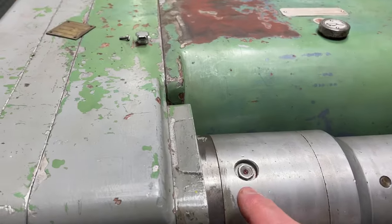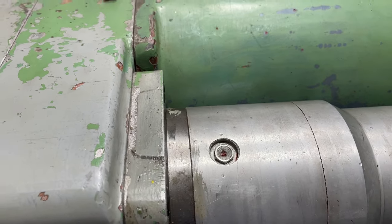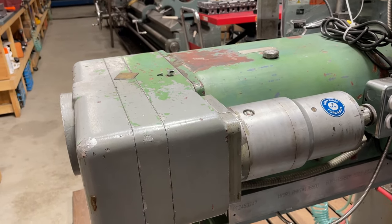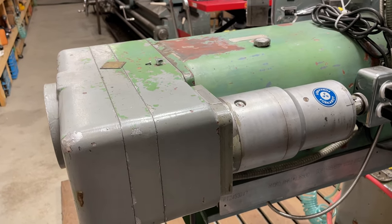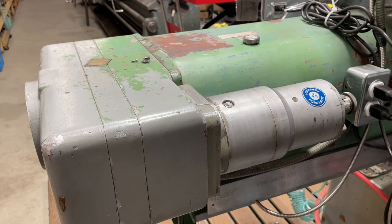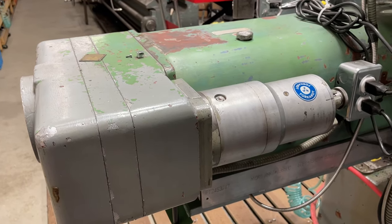And then I kept trying it, and over time grease was coming out of this hole, where you're supposed to grease it, and a decent amount. I found out I just had too much grease in there. And once it had spit enough grease out, it started working fine. Now it works really well, and grease is no longer coming out. So fairly soon I'll start actually greasing it again, as the manual tells you to. But that's the power drawbar on this machine.